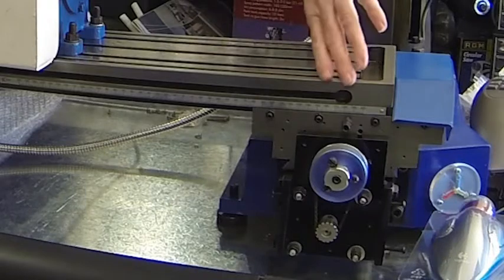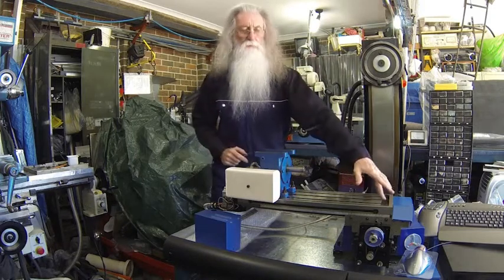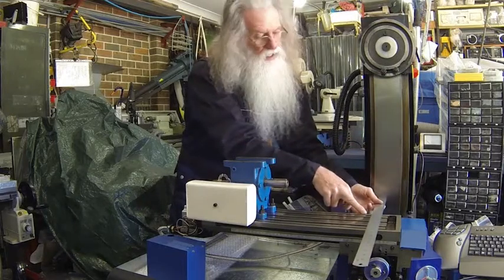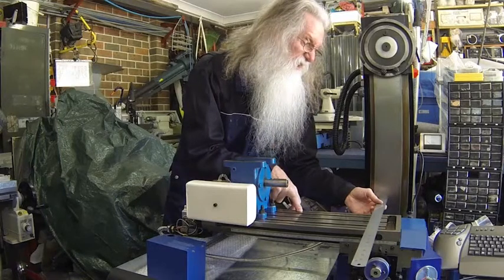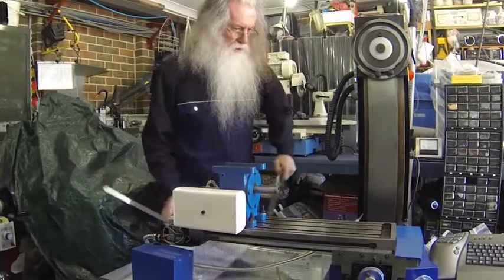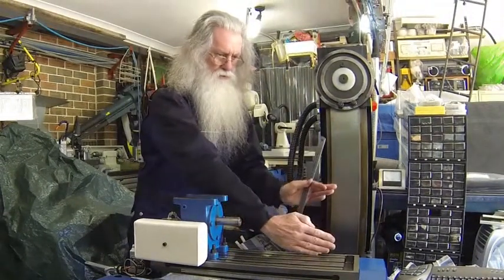The stepper motor is actually inside — I've added brackets that pull the motor inward and removed the handle. The motor does not move; the handle does not move. I've put it back to a conventional mill style where the nut stays still and the thread moves. The distance out from the column to the start of the table is nine and seven-eighths inches, or 252mm. The amount of travel I've got now, from saddle stop to the edge of the column, is 200mm — so I've got 200mm travel in the Y direction.